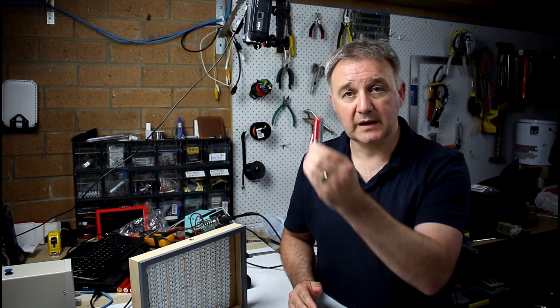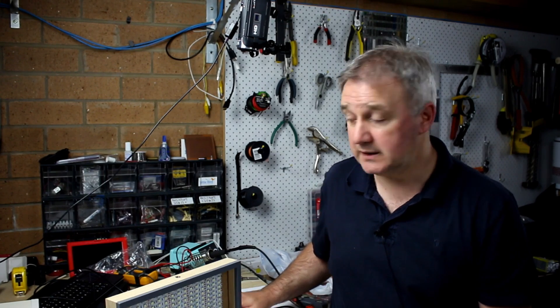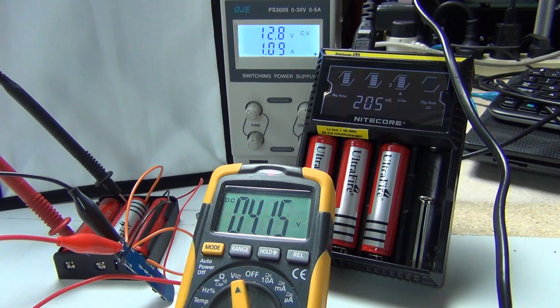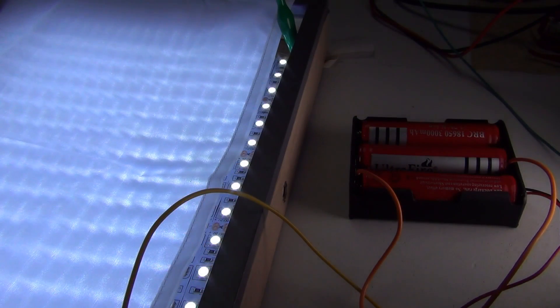I could repeat this test two or three times with variations, but based on the amount of power I saw being dumped through the BMS into the batteries versus the nice safe and conservative charge applied by the battery charger, I'm fairly confident that yes you can jam a heap of power into a battery and get a longer run time - 35 minutes. But if you wanted to maintain your batteries, keep everything safe and do it properly, you'd want to use a proper charger and not the raw dumping method that is the case with that kind of BMS. Thanks very much for watching - if you like the video give it a thumbs up, hit that subscribe button, and I hope you'll join me again in about a week's time.